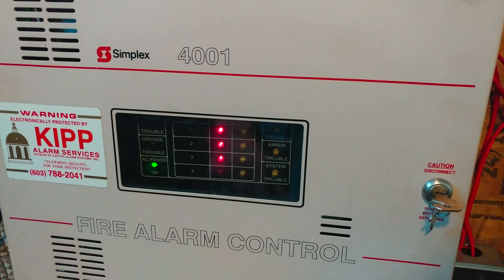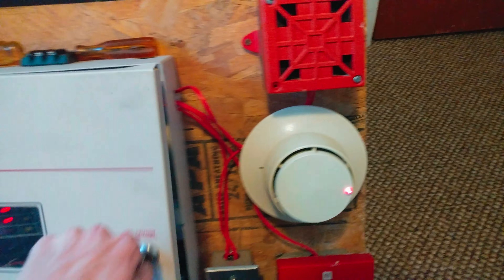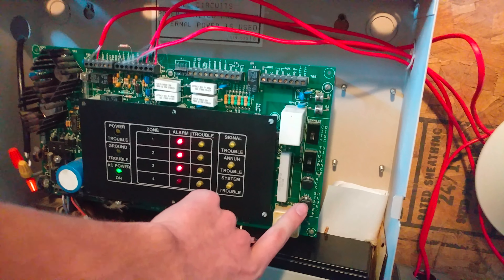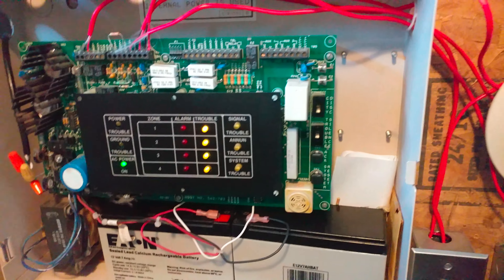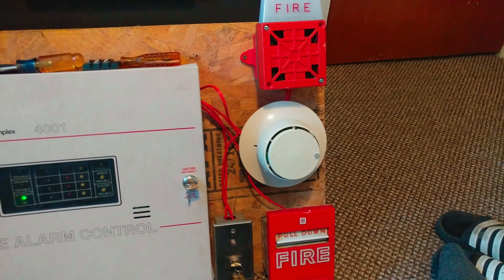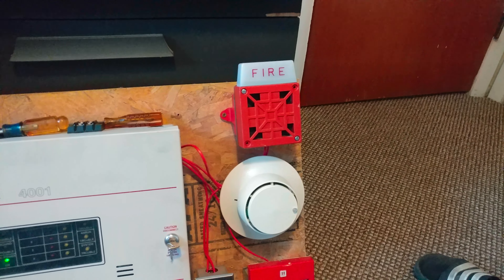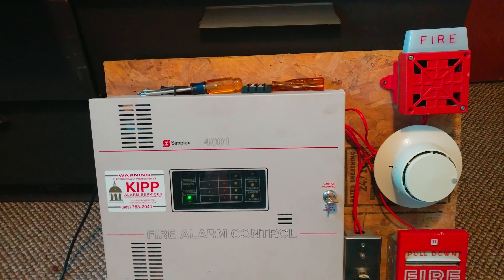All right, so as you can see, all three zones are in alarm except for the fourth zone, which is not hooked up. Hopefully I might see if I can get something for the fourth zone — maybe like a two-stage pull station. For right now I just have the end-of-line resistor on zone four marked as not used. Hopefully at some point I'll put a two-stage pull station on the system and hook the two-stage portion up to zone four. That would make it a lot more interesting — pretty cool.